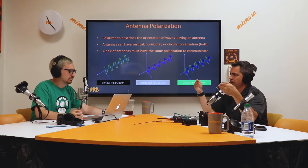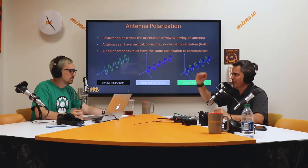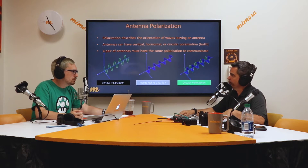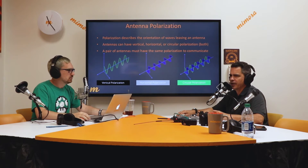They're off — they need to be aligned. At microwave, above a gig, 2.4 or 5 GHz, wherever you're operating, they're going to need to be right on, and the higher you go, the tighter that signal has to be. The good thing about Mimosa radios though — if you're 90 degrees off, it's autocorrecting in our software. But there are a lot of radios out there that don't autocorrect, and even if you're off at a weird angle, I don't think even Mimosa can adjust for that real well, so you'll still have that loss.